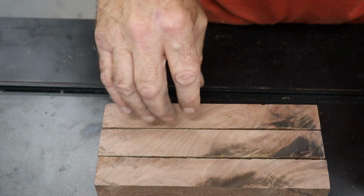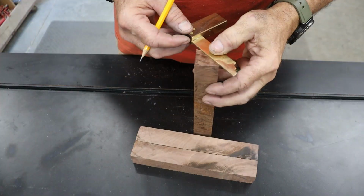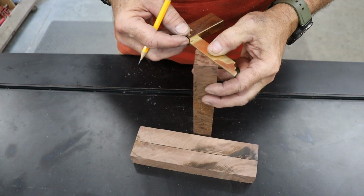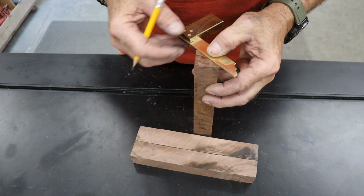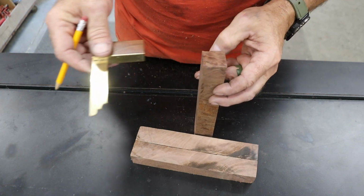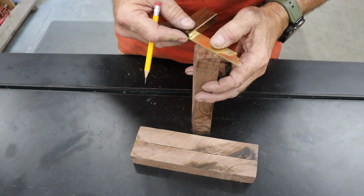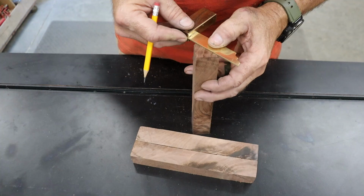I went with, you guessed it, black walnut. It's got that rich tone that pairs beautifully with both brass and steel. Classy, tough, and just rustic enough to say, yes, I made this myself. I cut 3 handle blanks, each roughly 1 1/4 inches square by 8 inches long. Then I marked the center on each end for mounting on the lathe.